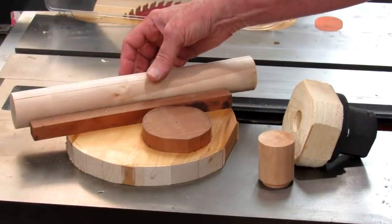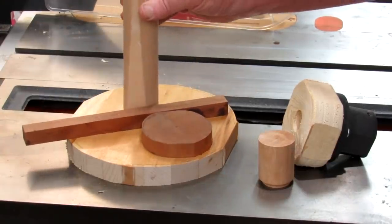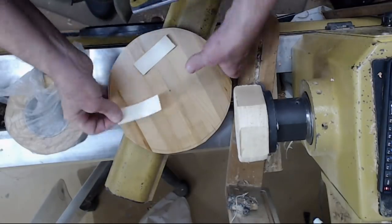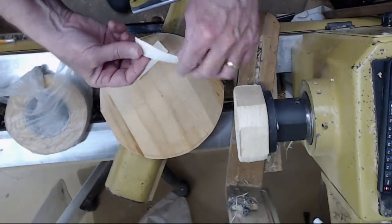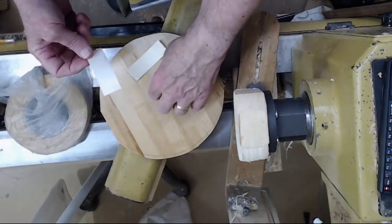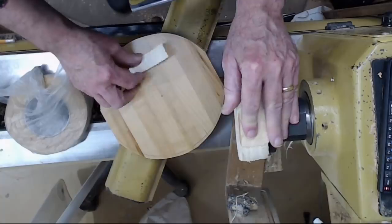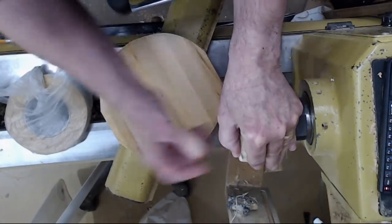When you're starting with square stock, you'll want something about 2 to 2-and-a-half inches square, and you'll turn it down to an inch and a half. The first thing we're going to do is mount this 8-inch piece of three-quarter-inch stock. You can do it several different ways — hot melt glue, or even turn a tenon on it like a platter. I'm going to use woodturner's double-stick tape, which works really well in these circumstances and will hold up just fine.